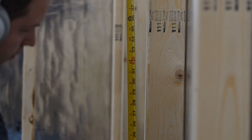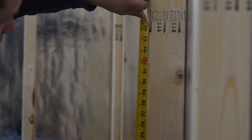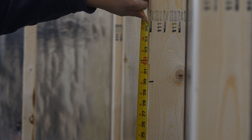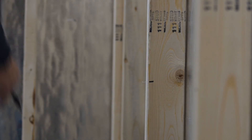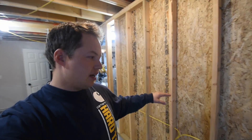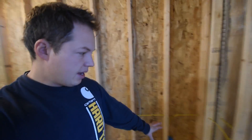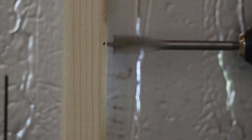With those wires being run horizontally through the wall at 30 inches, you'll know where they are. If this is your house that you're wiring, you'll be able to avoid that area for putting any longer anchors into the wall. It's also a good balance between the height of a switch and the height of an outlet, so you can drop down to an outlet or go up to a switch and have plenty of space to anchor the wire to the stud itself.